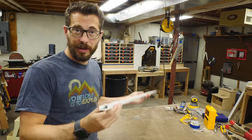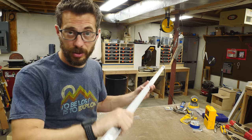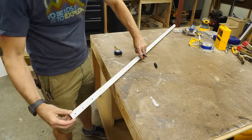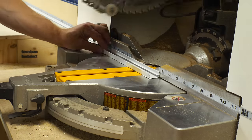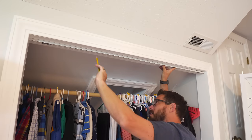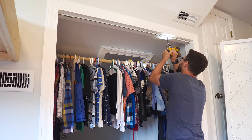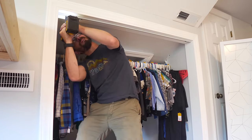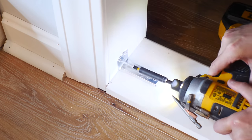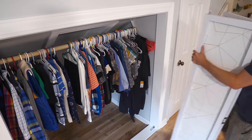Now it's time to hang them up. To do that we have to cut down the aluminum track to fit within the opening, so I measured the closet and cut it on the miter saw. The location of the track is really up to you — it doesn't matter if it's all the way in the front or back. I went a little bit forward of center so the gap on the front side of the doors wasn't too big. After screwing that in, I also screwed in the feet that go in the bottom — these go into the plate and into the side of the door jamb. The important thing is that the center of the track and the center of those two feet are all in line, so I measured all of that from the front edge.